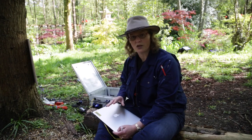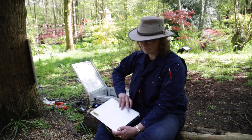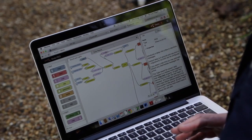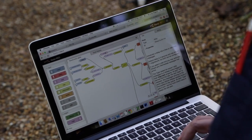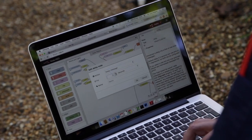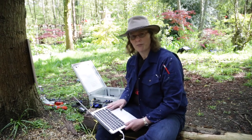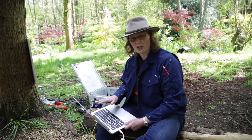So after the first run through, I realised there were some issues with the timing. So I'm just going to load up my computer, load up Node-RED, change some of the software and try and get it working better. I'm just changing the timing on the fog machine — the fog machine, the lights and the audio weren't quite in sync. So I've just tweaked some of the nodes on Node-RED and the timing. I'm actually controlling the Raspberry Pi from my laptop at the moment. Once I save it and close it down, everything will be on the Pi and we can give the firecrackers another go.